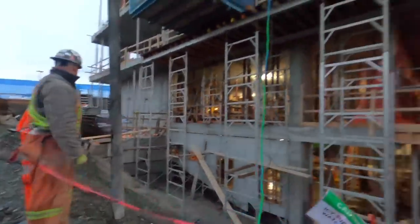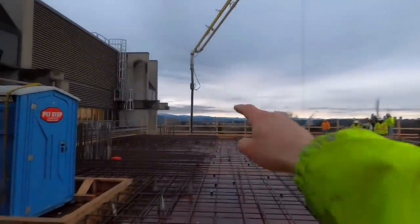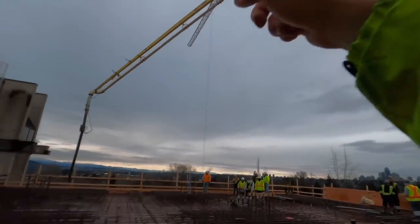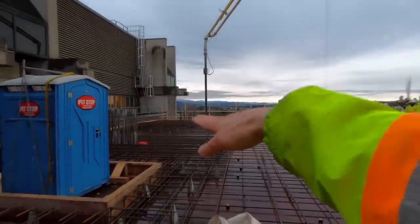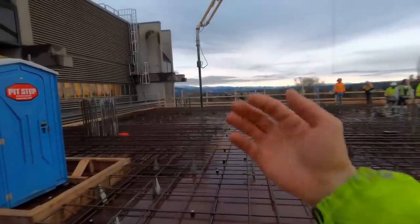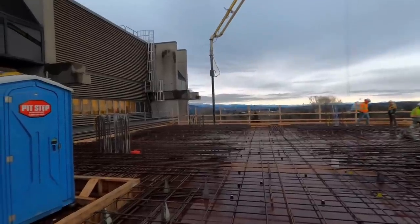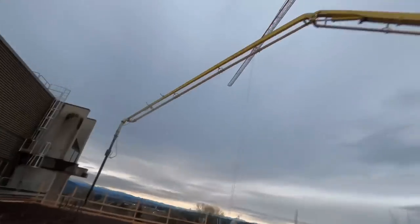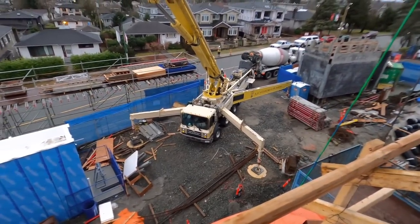Just like that, we are primed out. We'll jump up onto the deck now. They want to start the boom pretty much flat out, so we're going to dribble a little bit out here with a slight slope on that tip section, just get a bit of concrete moving, and then we'll go flat with it. I still don't like starting to pour with the boom completely flat out - get a little bit through here and then go right to the corner. It's close enough to where they're pouring that they won't get a big hard spot when they get back to this point. There we go, we've got flow - now they can stretch out and do whatever they want.